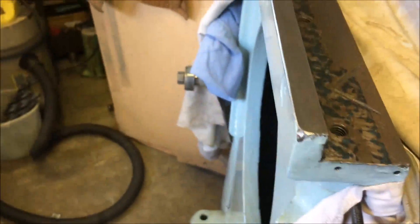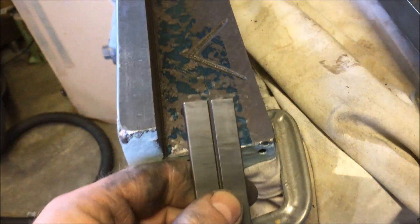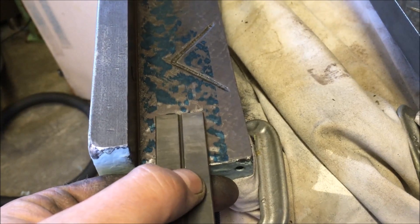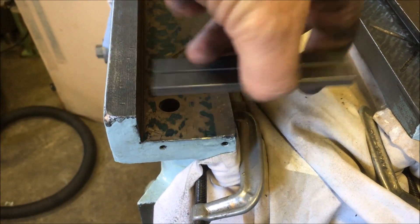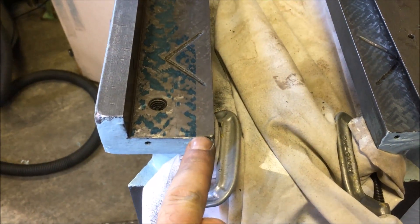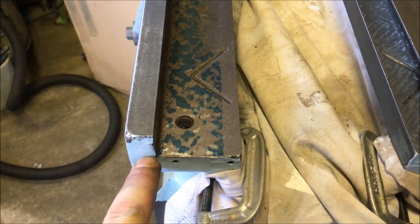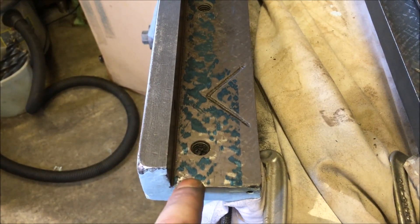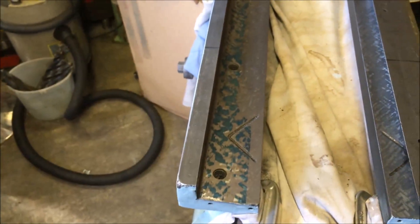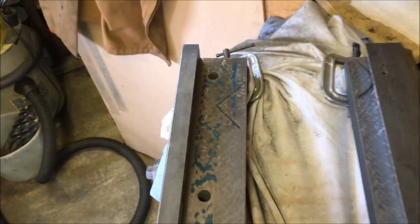What I'm doing is not taking off this section — just taking off everything that side. Thinking that, as we're looking down the end view, the base of the straight edge goes on here, rests, and I'm moving a quarter of an inch backwards and forwards. What I'm trying to do is not get a convex face but a flat one — so by leaving that position and taking everything this side of it down, I should start to get a progressively heavier print here as the material drops. Worst case I end up the other way around, but I'll deal with that when it happens.